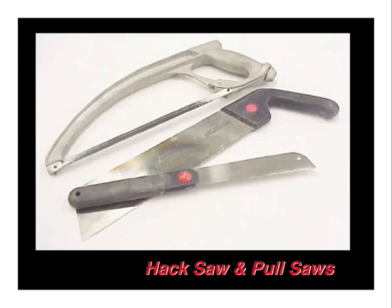You'll find some very limited uses for hacksaws and pull saws. First on hacksaws: obviously good for a scratch builder who's going to be doing their own welded components and needs to cut a lot of steel, but for a kit builder, almost completely unnecessary. On the pull saws, we found these are very useful for cutting fiberglass components — they make very nice clean cuts and are very easy to control. And of course, you have other uses for cutting materials around the shop with similar saws.